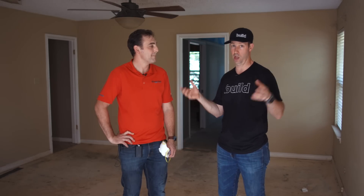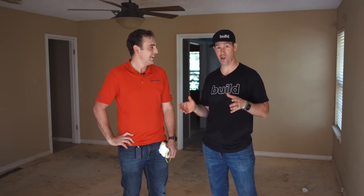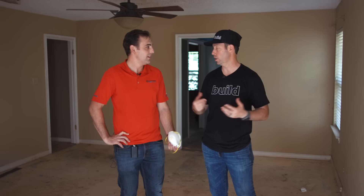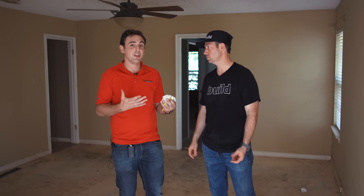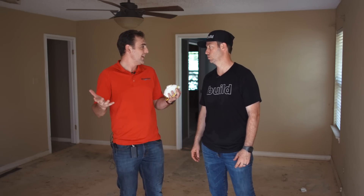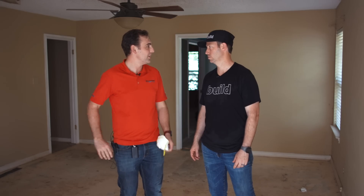In this house we're going to go all the way — I can't go halfway on my projects. But someone could come in and do some air sealing, re-blow the attic, and change out the duct work. The important part is that the testing means nothing without a recommendation and a plan for what to do with those numbers and in what order.